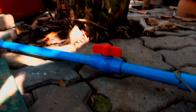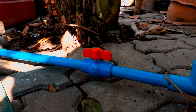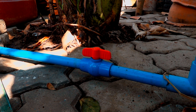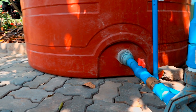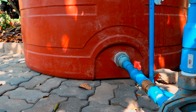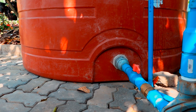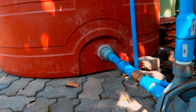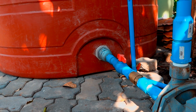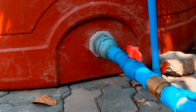This is the tank and you've got a little valve down here. This is the water supply for the tank and normally it'll be open and the city's water supply is used. When it isn't used, you turn the valves closed and then you go to your water meter and you shut that off as well. That way, when you use your pump here, you're not pumping water to your neighbor's house. This is the outlet from the tank — just a similar outlet that you'd find anywhere. And then you have a valve with a little red handle there, which is a shutoff valve to the water coming out of the tank.